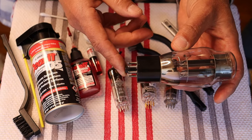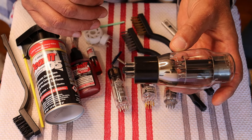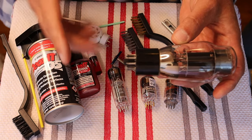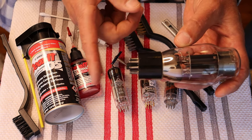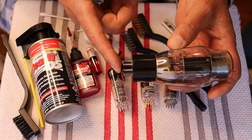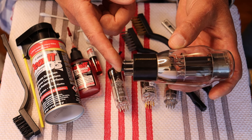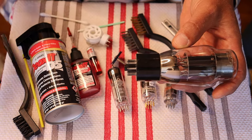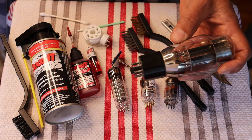You may have recently bought or found new old stock octal tubes — new in the box — but you pull them out and the pins look heavily oxidized. Is that a sign of a defect? No, it's not. It's just normal oxidization. Even in a cardboard box, the environment of the storage area is moving in and out of that box fairly regularly. If the storage area is anywhere near the ocean, within a couple of miles or kilometers, you're going to have some corrosive salt in the air moving around, and it'll make these even go green.